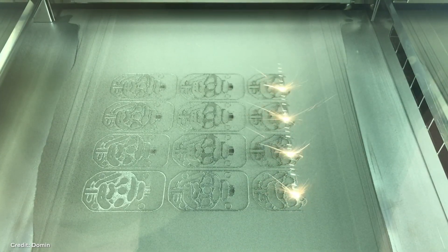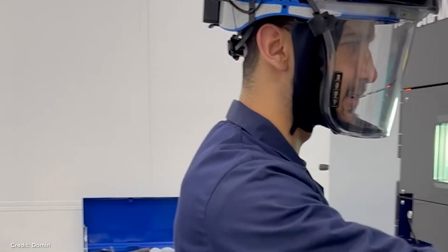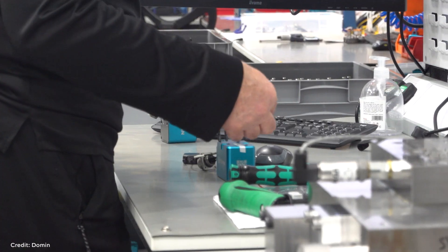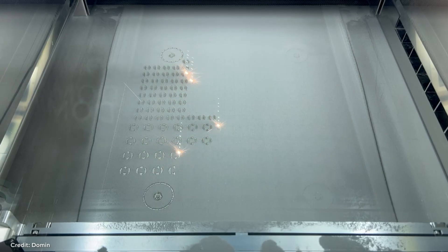Domen is now in a world of volume manufacturing, printing 24/7 with 3 machines running all the time across a variety of different valve sizes. Batch sizes range from 12 valves on a build platform through to 20–30, and depending on the components, sometimes 300–400 components on a single build platform. There were two big arenas of innovation: reconceiving the valve completely for additive manufacturing, and then developing and establishing a repeatable, reliable, cost-effective production process using laser powder bed fusion.